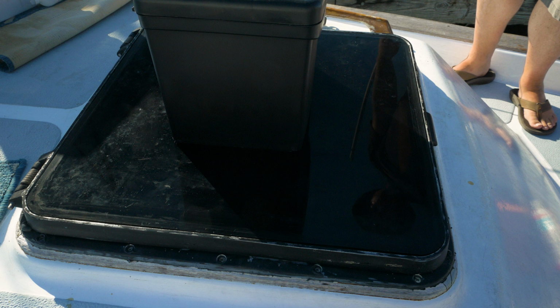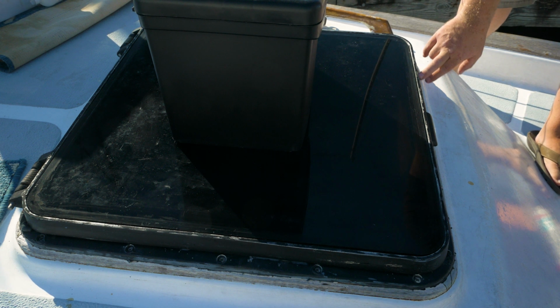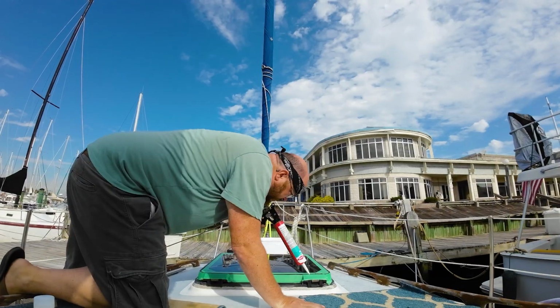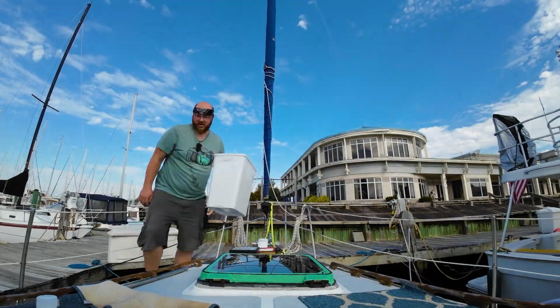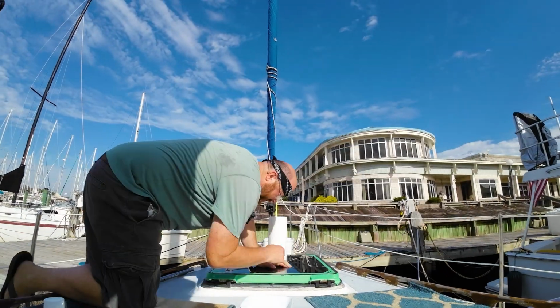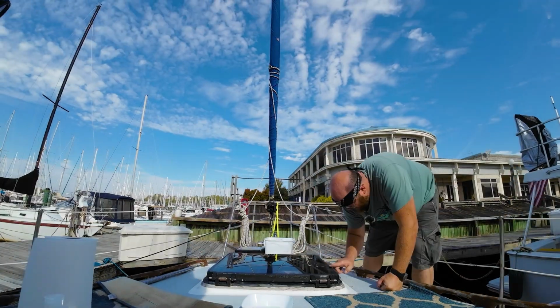Okay, so the idea is that we're banking on that first seal to be the seal. But then tomorrow, that gives us an opportunity to mask this surface wherever we want, width-wise, typically right to the edge. Then you cut it quite fine, so you squish it, using the tip on the angle where you're actually squishing it down into the gap as you go, and you want it to sort of dome up. Then you go around with your finger and wipe until along those edges you can see the masking tape, and once you can see the masking tape, that means the caulking layer is super thin. Once you get all that done, you start peeling the masking back and it leaves just the perfect line. By doing it that way you get a double seal, because right now, if you're masking and moving things around, you could potentially break this first seal.